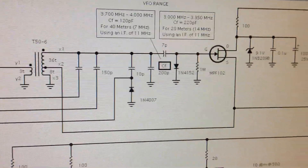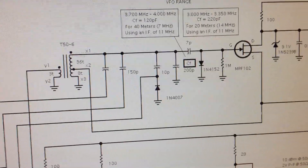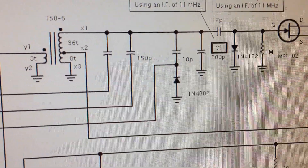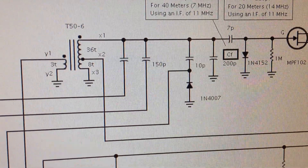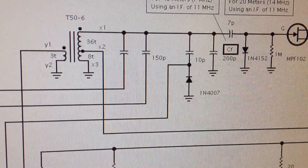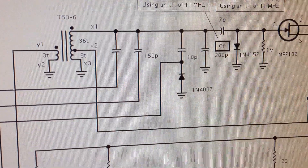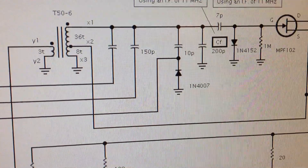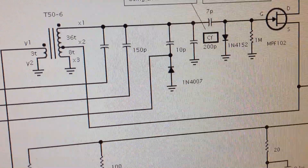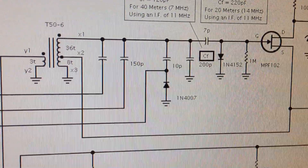This is an analog VFO circuit. In it, I use a general variety 1N4007 rectifier diode for a varactor diode. Of course, you can get varactor diodes that are specifically designed for RF work. They're usually needed if you need exceptional temperature stability or greater range or other reasons. If you're just doing amateur radio experimentation, you can get by with one of these general purpose rectifier diodes.